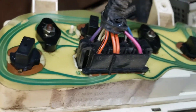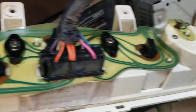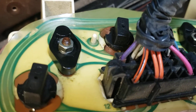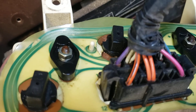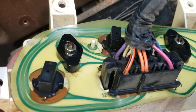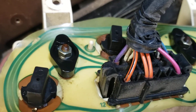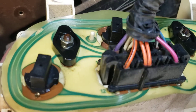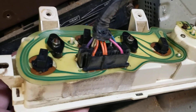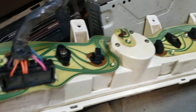All of these contacts — I've already gone through and done it, you can see it looks a little shiny. There's a specific kind of grease I use. You take that nut off and remove that black diamond-shaped thing, and on the two far ends there are male brass posts. Take a real fine sandpaper or emery cloth, something very fine in the thousands, and clean that up real good — get all the corrosion off. Spray it with electronics cleaner, then spray it with electronics lubricant like dielectric to stop it from rusting again. I did the same on the printed circuit board on all the contacts for the light bulbs and the clock contacts. Be real careful on the printed circuit board because it's incredibly thin copper — you only want to hit it just enough to clean it off.